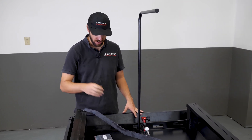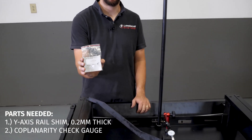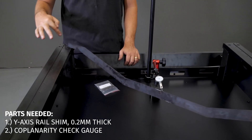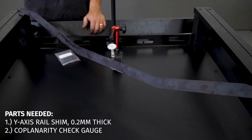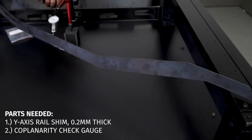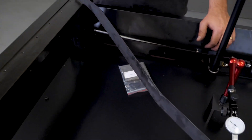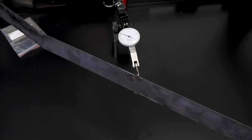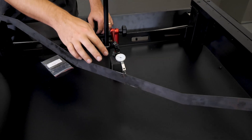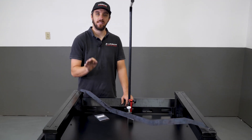To do that, we're going to need a few items from your kit. You'll need the 0.2 millimeter thick y-axis rail shims, and you'll need the coplanarity check gauge, which I've got resting on the y-axis rails along the diagonal. The coplanarity check gauge is a piece of laser-cut sheet metal. It has two points on either end that rest on the floor of the slots cut into the y-axis rail.